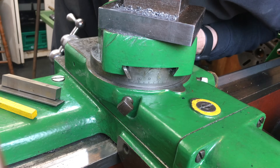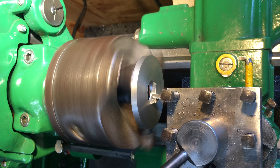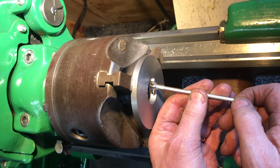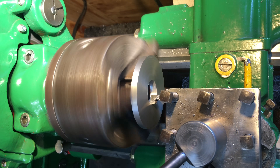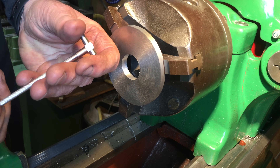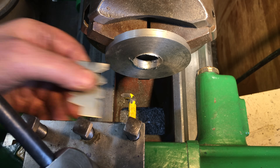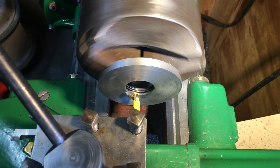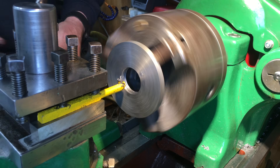This is where I set the compound angle to 30 degrees for the bore threading operation. Each washer in turn was machined to size in the bore and double checked. I've used a high speed steel cutter for this job — I've grown fond of using high speed steel cutters in this machine because it leaves such a nice finish to the touch, though visually it couldn't look any worse if you tried. As with everything so far, the bore threading is something I'd not done yet on this machine, so it was pucker factor 10 for the first throw of the half nuts. But as with everything else, it was smoother than silk with just a touch of cotton.